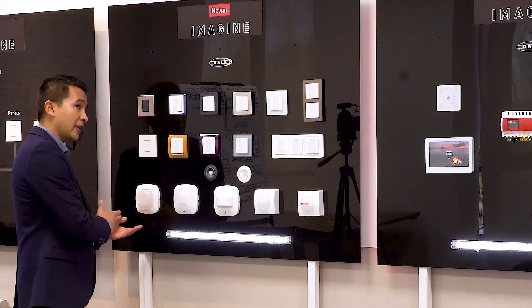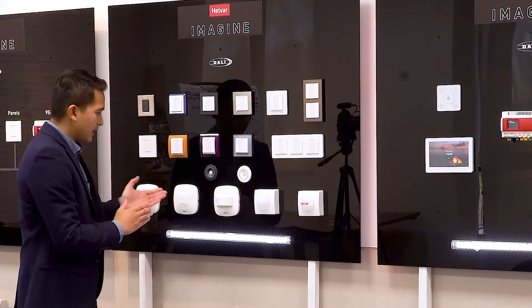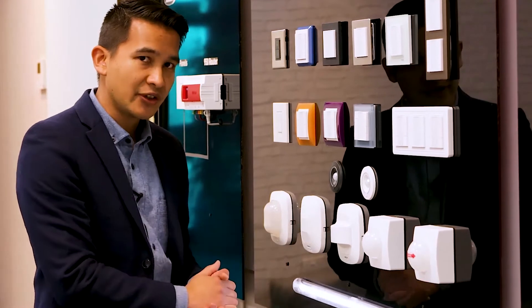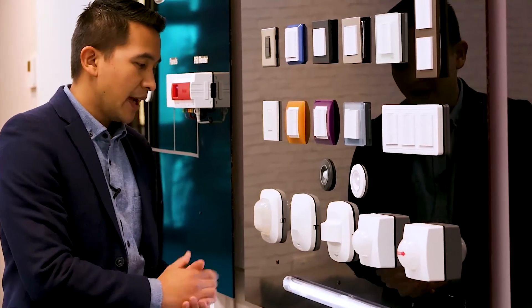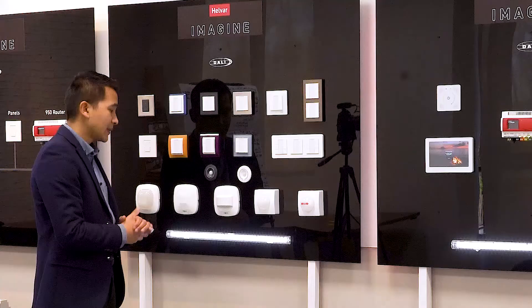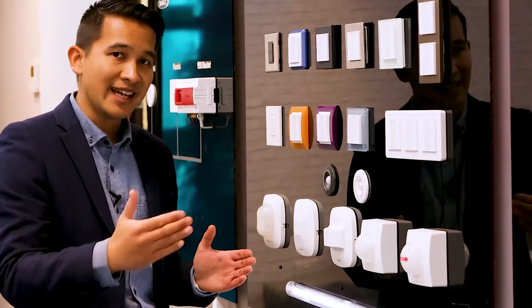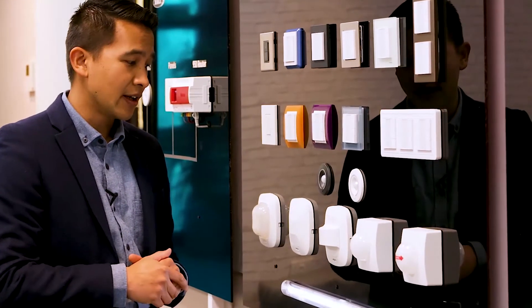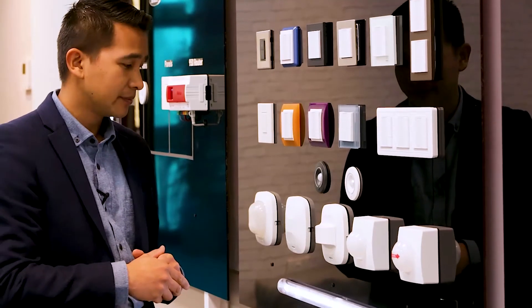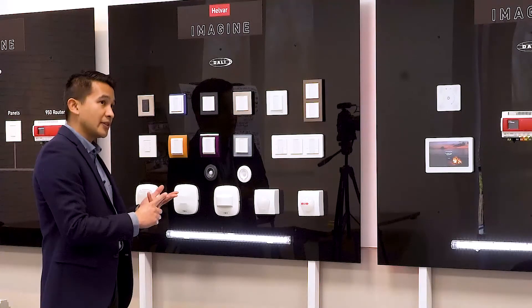The IR Quadro HD can be mounted from 2.5 meters up to 10 meters, making it suitable even for sports halls. The next sensor is the HF360, which uses high frequency detection — sometimes called microwave in the UK. The key benefit over PIR is that it can detect motion without line of sight. For example, if there are partitions between desks, as are now common due to COVID, it can still detect people behind those partitions and keep the lights on. High frequency can also detect people through materials such as glass, wood, plasterboard, and plastic.